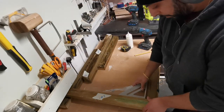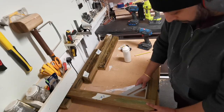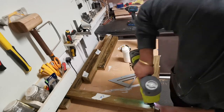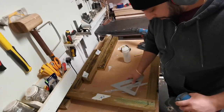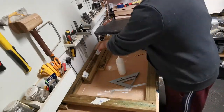Here I'm using the wall of my workshop to give me a straight line to work against, and I'm using a square to make sure that the pieces are perfectly 90 degrees to each other. Then you'll see how I angled the back leg at 15 degrees to give me the right angle for the position.